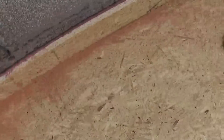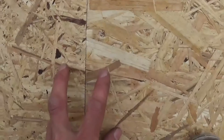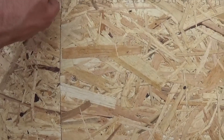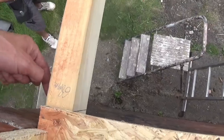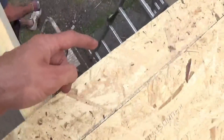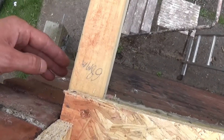When you're applying these boards to the joists, it's always a good idea to mark where the end of your joist is. On each end I just draw pencil lines along them, and that gives you a nice straight line to work your screws along when the boards are down if you can't see the joists. You can see that the joist runs along there. You want to measure your joists so that the centres meet the edge of the boards - that way you can get two boards into one joist. To get the straight line for the edge, we've worked out the depth we need for our fascia board, put a nail in each end and ran a string right the way across, then marked lines along each joist where the board needed to go.